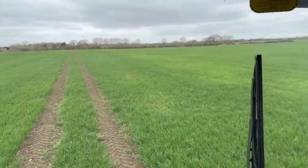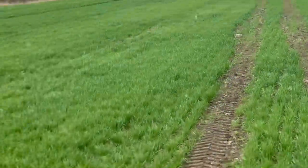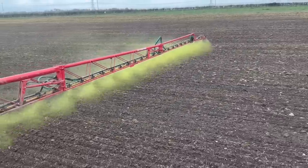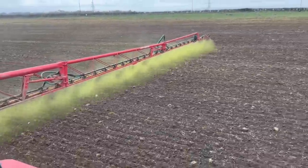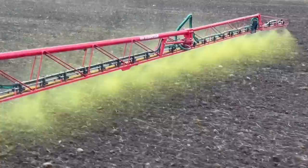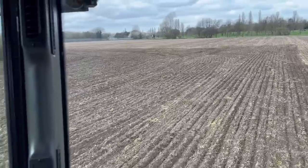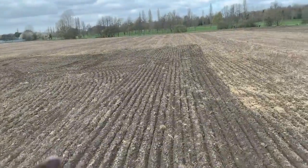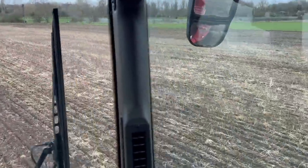Just washing out now as a pair just running in front of us. Out now spraying the pre-emergent spray on the beans. You can really see the spray pattern in the forwards and backwards facing nozzles so that we get no shadowing. Just swapped fields now - this one is the headlands that were done with Sumo, just to try and level them out and get rid of some of the water from when it had potatoes the year before, and wheat last.